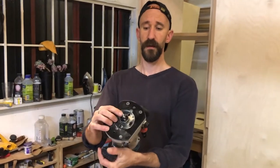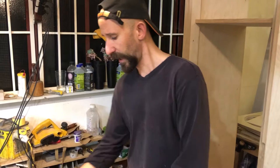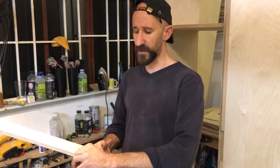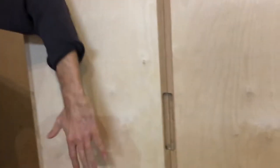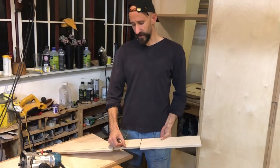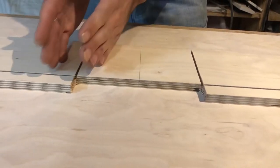This specific cut I've used for finger pulls on drawers and doors, and a collet as well with an offset. This works with a template like this one. It's a very simple template but it's got to be accurate and transferable from left to right, bang on every door. If you have two doors matching left and right as mirror images, they will always be matching. The main trick is when you make the templates, reference all your measurements from a center line, and then you have a mirror image from left to right.